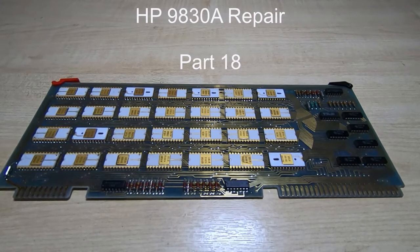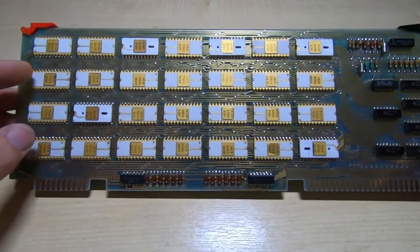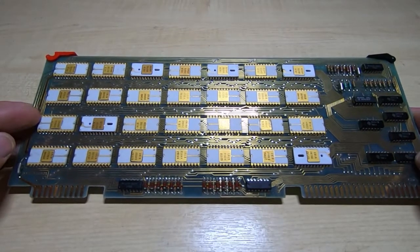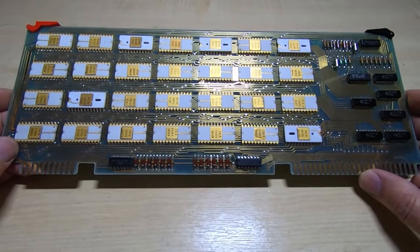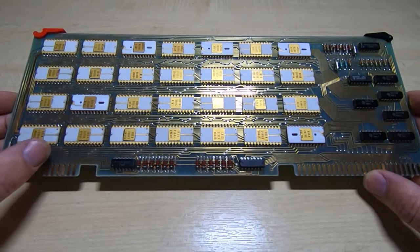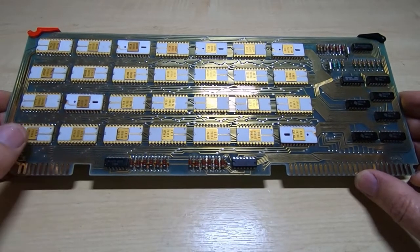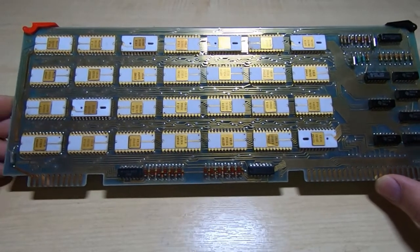This is the 18th in a series of videos in which I'm attempting to repair an HP 9830A desktop calculator. In the previous videos I've detailed repairing a lot of electronic faults, replaced a lot of ICs, but then came to the conclusion that there was a fault on the ROM card. There are at least three or four failed ROMs on this board, and I went about proving that in various ways. I made a jig to read the data from it, compared that against the original patent, and used code from the 9830 emulator for comparison, writing various software utilities to do the comparisons and file conversions. It did look like the fault was with this ROM card.